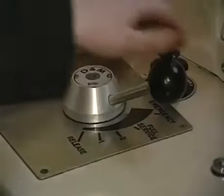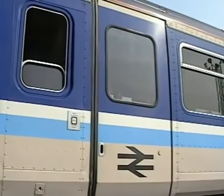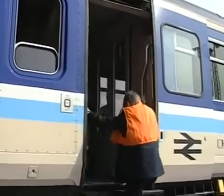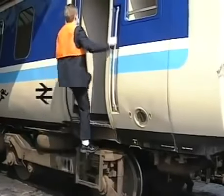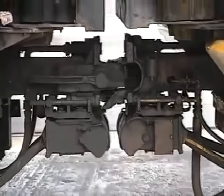He now moves his brake controller to the step 2 position. He now proceeds to the other unit. On this unit, he must check that the brake has released to the equivalent step 2 position. If the pull-away test is unsuccessful, the driver must now move the 2 units apart